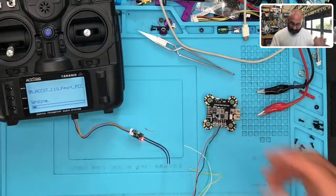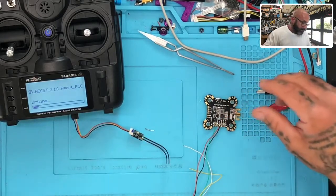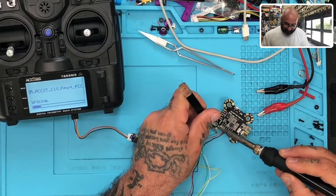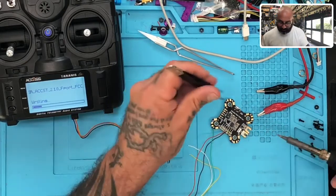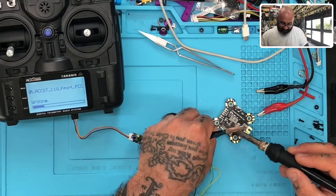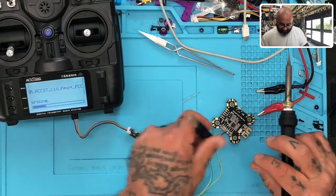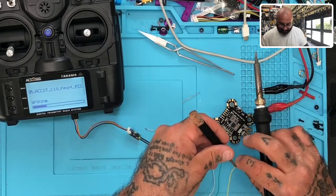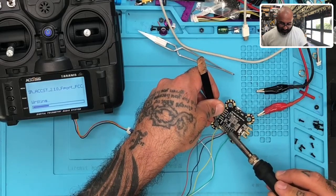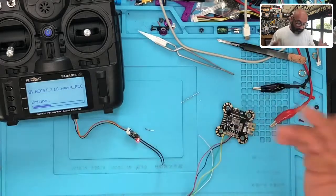While that's happening, I'm going to prepare my flight controller at the same time. I'm going to remove my S bus cable and I'm going to stay with the same UART — this is UART3. I'm going to go to the TX now. I'm going to take the S port wire, which is right here, and that will become my F port wire. So I can get my telemetry and do my radio signal on TX3 as one. This is an F7 board, so there should be no problems with this.